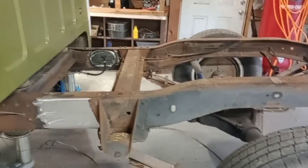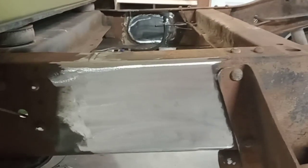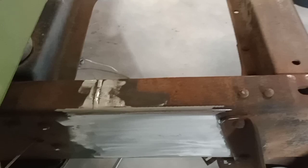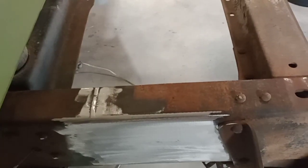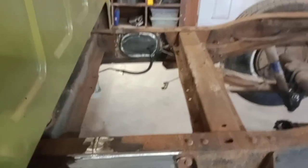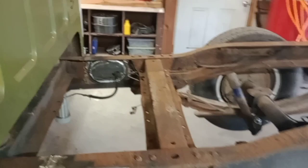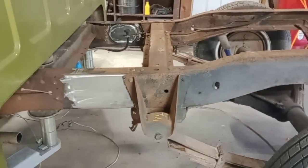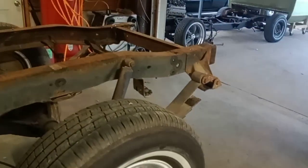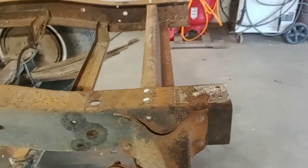Wrapping up this truck — still got to put the wiring in and splice the brake line. Here's the finished product on the frame — you'd never know it after you paint it nice and smooth after grinding. Always leave the weld on top; no one ever sees that. Got my fish plates on the inside — I'm about to design some on my burn table that'll look a little different, sharper pointed, and probably have my logo in them so I know what trucks I've done.